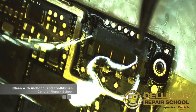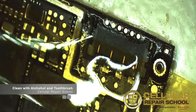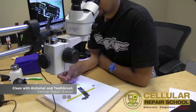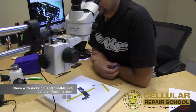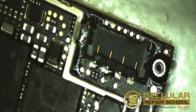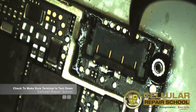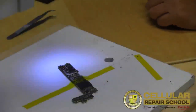It was very minor and that's okay, but it's very hard to avoid when you're applying 480 degrees Celsius to a piece of plastic — it can melt very easily. We should still be okay; it looks pretty sturdy. Let me remove my tape. When you're applying heat, I'm not brushed up right against it — I'm probably about an inch and a half away. Looks like we got this soldered on. I'm just going to lightly tap it to make sure, and we do. I'll clean it up a bit and get that excess flux out of there.